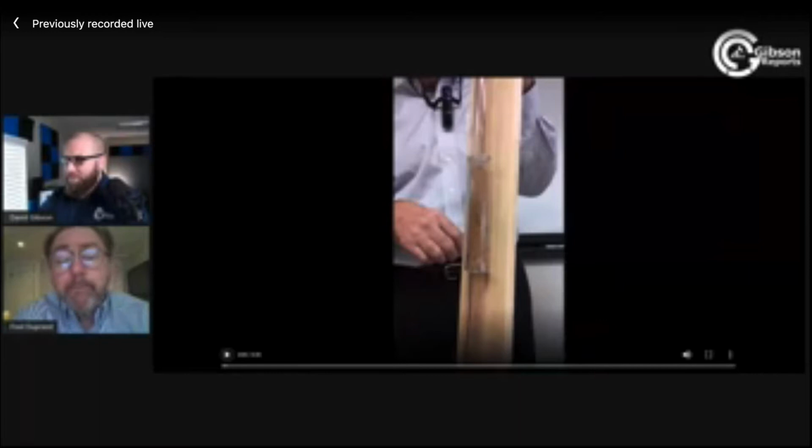Sorry. Yeah. So you're going to see the cuttings arrive, but very few cuttings come out. And what's happening is that the slip velocity is greater than the flow rate. It was fine down in the gauge hole. As it crowds up, go ahead and run the video there, David, if you would.